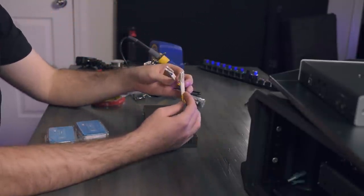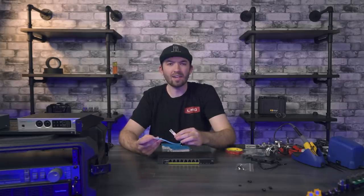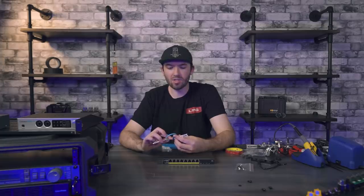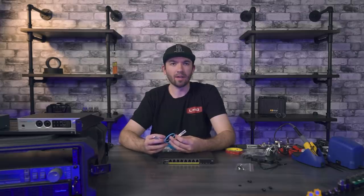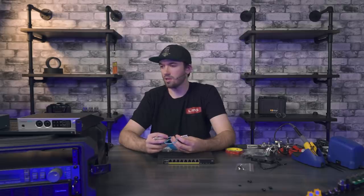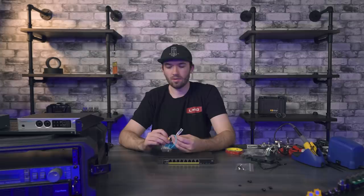It's a nice little cyan color. And it's like a grade of cable. It's how fast it can transmit and how far it can transmit. So I picked OM3 because I'm typically in like 100 meter scenarios, and any of the fiber connections that are going to be coming to the rack are going to be around that length. And this is multi-mode as well.